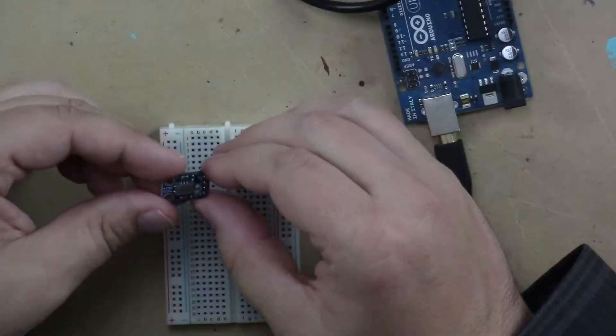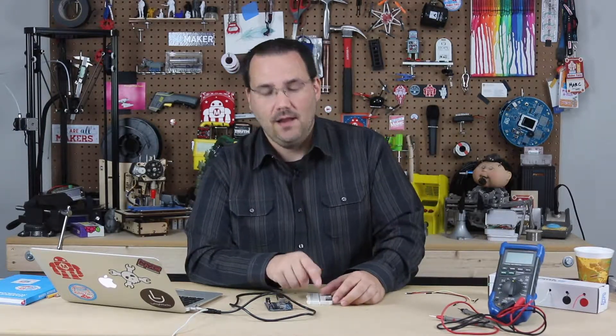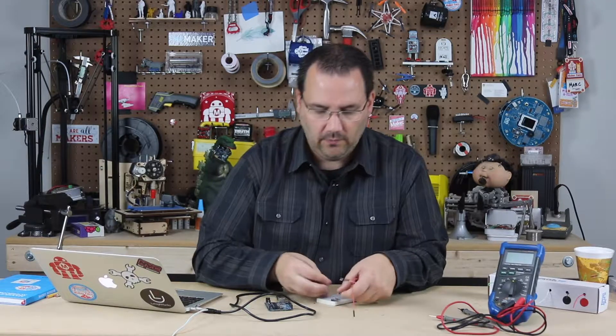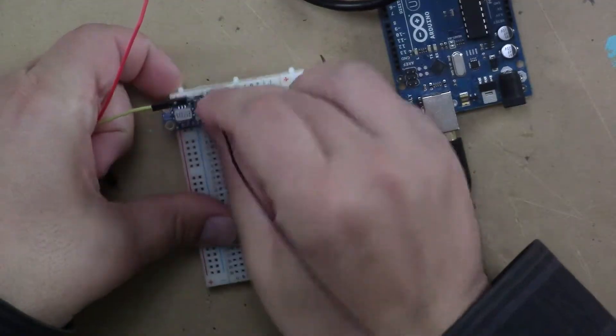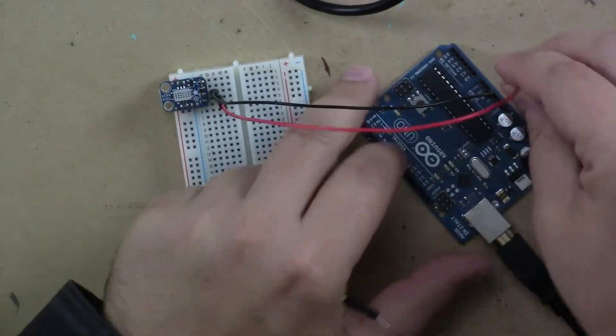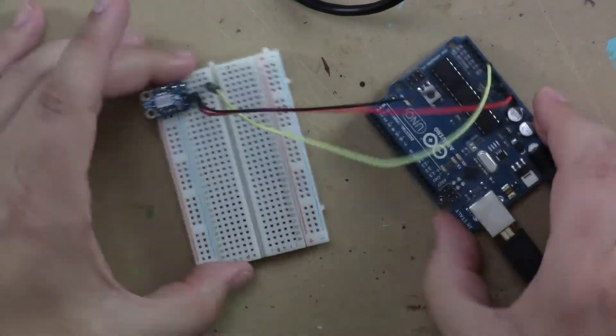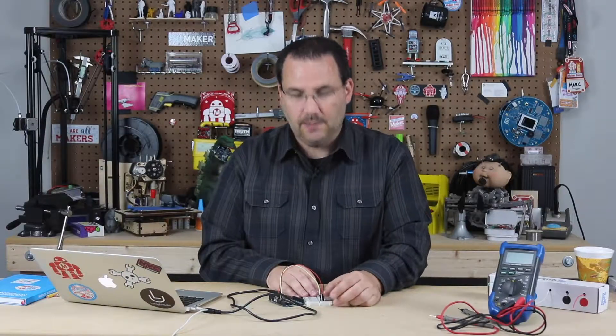Let's hook it up. I'm going to use rows one through four on my Arduino — there's a five-volt pin, a ground pin, and the analog pin. There's also an enable pin labeled EN; if you connect that to high it will actually turn the sensor off, so we are not going to connect that one. Let's connect up ground to the Arduino ground pin, then connect the five-volt to the five-volt pin, and analog zero to analog zero. Keep in mind that when this first starts up it uses a small heater, so we should allow a few seconds for it to get up to temperature and be ready to work.